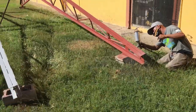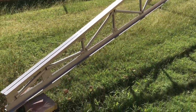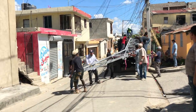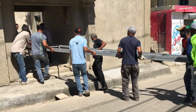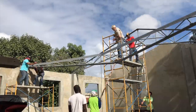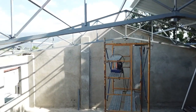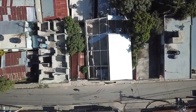I have a few more videos on painting and finishing on the channel if you're interested in learning more about spray guns. Here everything's loaded up on the trucks and strapped down. We're on the way to the job site — you could definitely use a crane for setting these trusses but there were a lot of people and they just carried them in. Using some scaffolding and ropes, it's amazing how with a little bit of thought you can get them up and welded in place. All the purlin material is inch-and-a-half by three tubing, about 16 or 18 gauge, which is relatively economical.